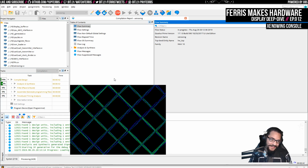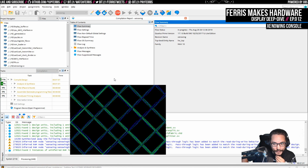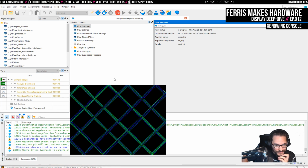So really, if we have full utilization, then we're just adding a few clocks of overhead. A few cycles of overhead, which shouldn't really matter, but practically speaking, it might. So a few cycles of additional latency shouldn't be bad. Per primitive, I think, is how often we'd pay that. And again, how often we pay that depends on the rest of the pipeline implementation, how efficient that is. So a lot of factors here.